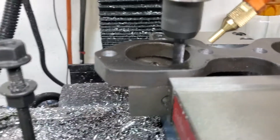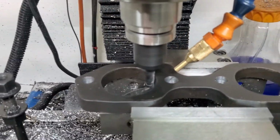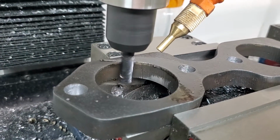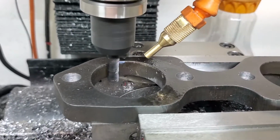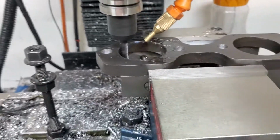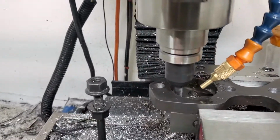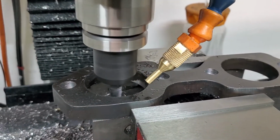Probably really loud. Should have maybe turned off. All right, there we go. Now we're touching. Just a really light touch. So you look down at the bottom, you know, sometimes you get a little bit of a taper on the cut with the Hypertherm 1250. Even though I'm cutting it at 80 amps, you still just get a little bit. And this can make the difference between me sliding in my pipe perfect or me only being able to slide in my pipe halfway.